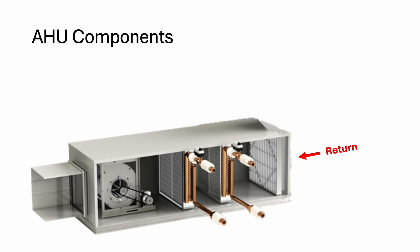One of the disadvantages of free return is if the AHU room is a bit leaky — sometimes the door has a gap — then you start sucking air from other places. Also, you want to open the AHU door and it's a bit difficult because inside is negative pressure. So there are pros and cons. The advantage is you can have a smaller AHU with a smaller footprint, which is valuable in commercial space where they don't want mechanical equipment taking up too much space.